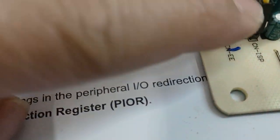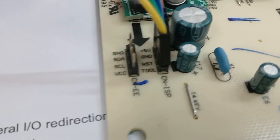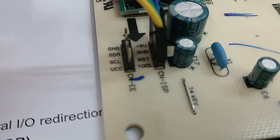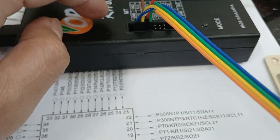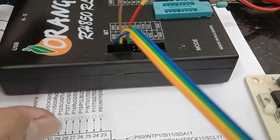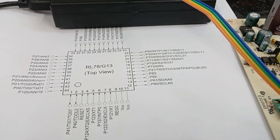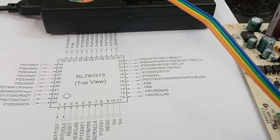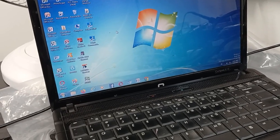There is already a terminal for the ISP connection and for the EEPROM. I connected the Dupont fly wires going to my universal MCU programmer. I downloaded the datasheet for the IC and I will try to copy the data and save it to my computer.